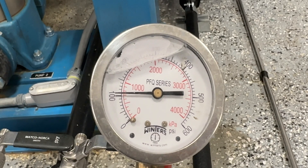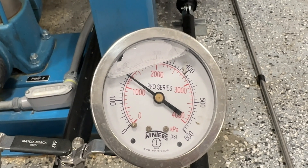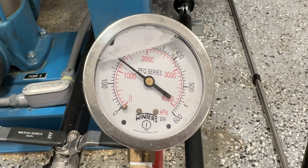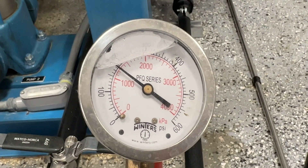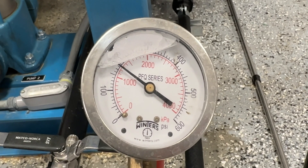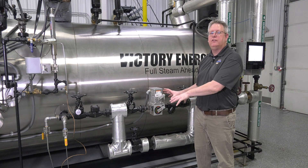At a minimum demand, when this valve is mostly closed, we'll approach the maximum possible pressure on the outlet of that pump. We've actually got a recirculation line at the pump to ensure some flow even though this valve is closed.